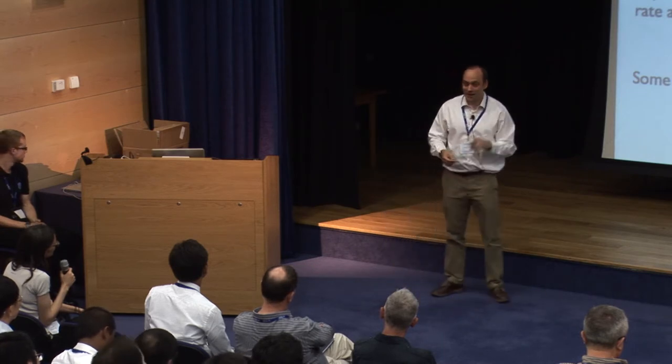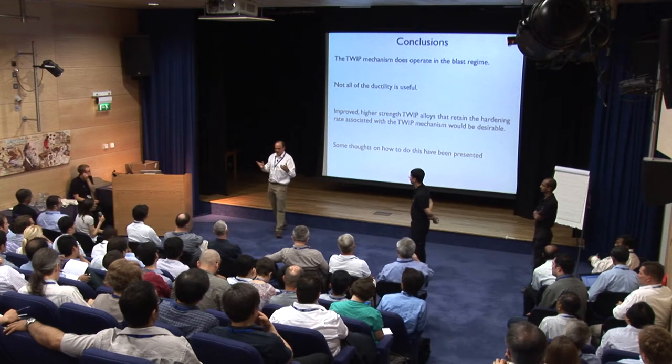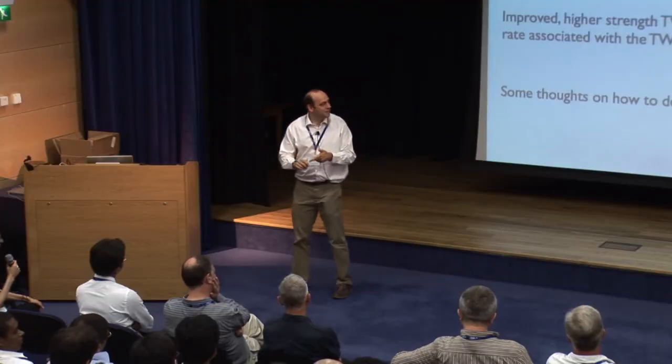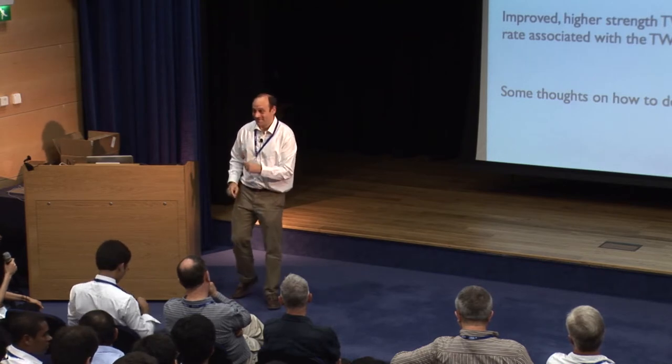But it's interesting, right? We think of twinning as being a shear process that operates in zero time, right? And if there's two things I hope to have persuaded you of, really, it's that it's not a shear process that operates in zero time. It's a dislocation process. Dislocations in motion are actually moving quite fast. And we don't understand dislocation dynamics very well, okay? If we're honest. We can engineer with them with our brains and some insight, but dislocation dynamics is quite immature. The other point that I was hoping to make is there's more to life than a UTS ductility curve. Yeah. Okay.